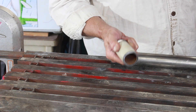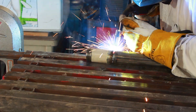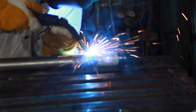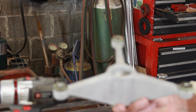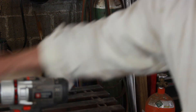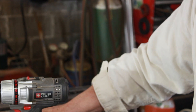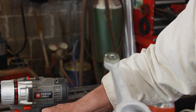Don't forget to sand the paint off before you start welding. This is the mounting — I'm going to put two of these on a rafter, and then I'm going to install a cross beam on the rafter for the third leg. Then we'll just bolt it on with lag bolts.